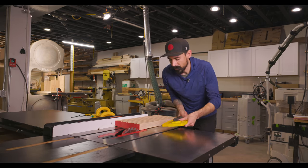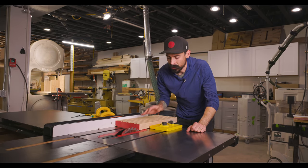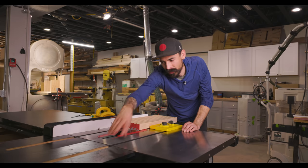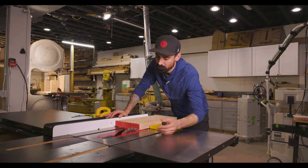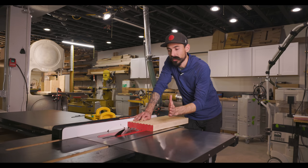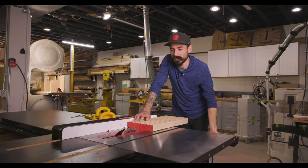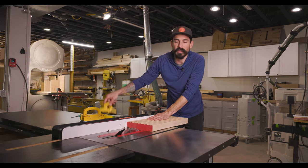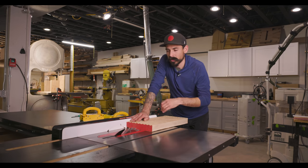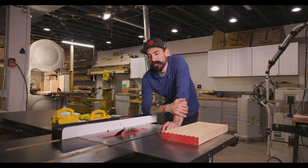Another really good tip is to use a feather board. As long as the face is jointed and the board is already cut to width, you can use a feather board to push against your material and help prevent kickback. You never want to place the feather board past the blade — it always needs to be in front. If I'm doing a potentially dangerous cut without doing the band saw step first, I'm going to hold down a bit harder, definitely have a push block in place. As soon as the cut clears the end of the blade, you can usually see the wood moving if it's going to bind. Watch for that and use your senses to prepare for something that might go wrong — you have to be in tune with your tools.